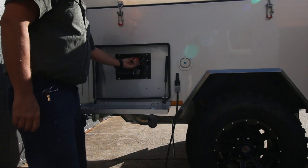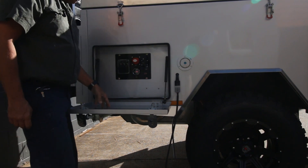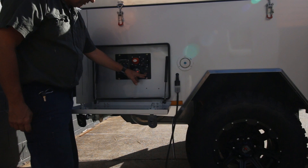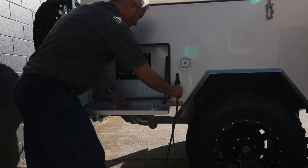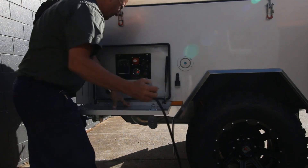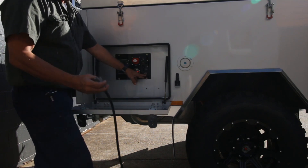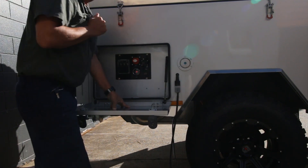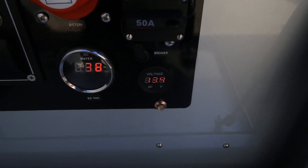You can see what's going on by turning on the power. We have 13.3 volts. When the panel is not plugged in, you can see it immediately drops down to 13.1 volts. That's how you know your solar panel is actually charging — the voltage goes up. As the panel remains connected a little bit longer, it still increases. We're up to 13.4 now.